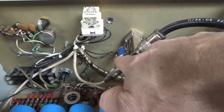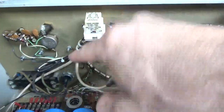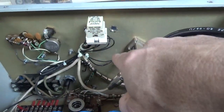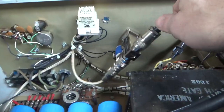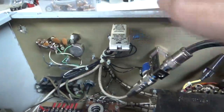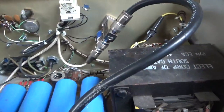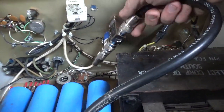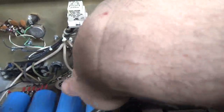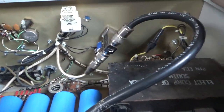I put a diode across the coil to stop the spike from going back into the radio. These coils are in parallel with each other. It's re-secured to the back wall — the back wall isn't secured until the two top screws go in. I re-soldered the wire to the coil. These were loose — big-time loose on both sides. This is the most important one — the output coax. I tightened that up with pliers.